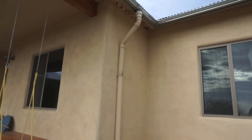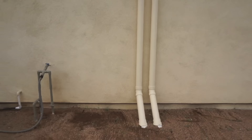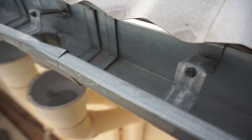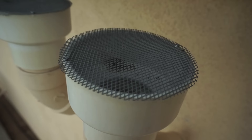Moving across the yard, we'll come to the first of seven connected PVC downspouts that comprise the majority of our water harvesting capacity. All of these downspouts are connected to a four-inch PVC pipe that runs underground and eventually leads all the way to our main rain collection tanks. Here's number two and number three — they both collect from either side of this run of gutter. The tops of the downspouts have bell couplings, and I've simply screwed standard aluminum wire mesh there to keep bugs and debris out.